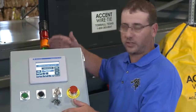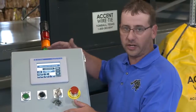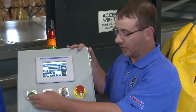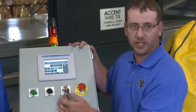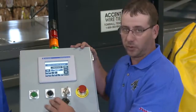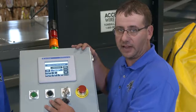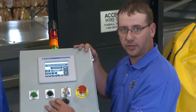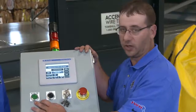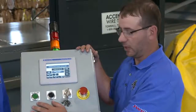Simple indicator lights — red, orange, and green — all have different meanings. The controls down below: two buttons and a key, basically. E-stop if anyone has a problem, simple reset after an E-stop or when you power it up, and a simple start button. This will function in auto mode about as easy as it gets. A key for security allows owners to control who has control of the baler.